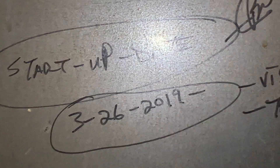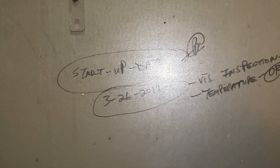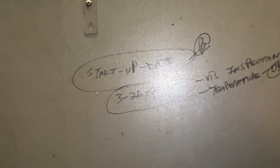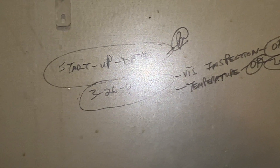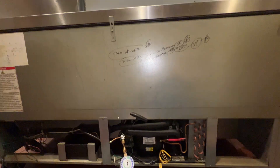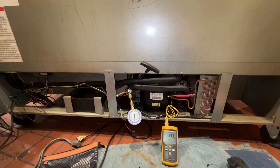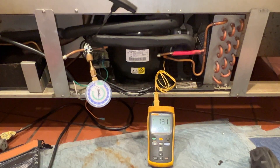We've got a 2019 Hoshizaki that only lasted from 3-26-2019 till about 8-7-2025. It's not a condensate loop issue because we don't have a condensate loop there. Most likely it's an evaporator leak inside because of something. That's all she wrote — I'm not even going to fix this thing, because if you've got one leak, you've got another leak coming down the pipe, and the thing's done.